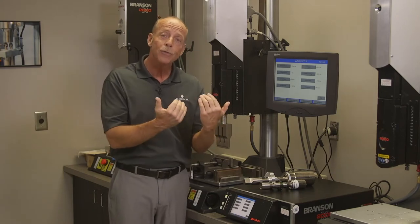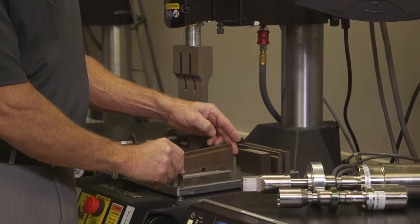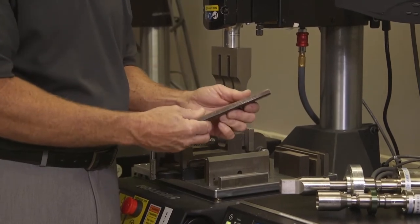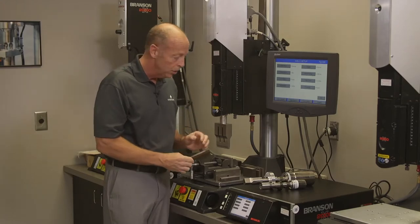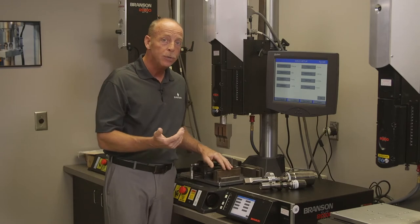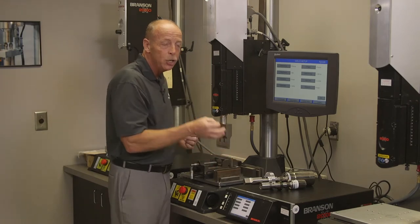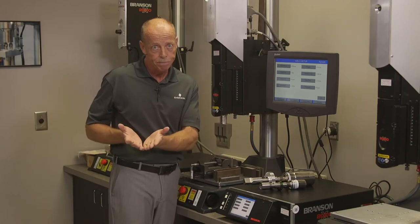But on the receiving or fixtured side, anvils can be configured in many different configurations, similar to heated bar tooling. So many customers will want the thinnest seal surface possible to save material. Some will prefer a serration or a knurl. These patterns are very commonly used in both technologies, ultrasonics or thermal bar tooling. So my point is the lower fixturing is not unique to ultrasonics as much as packaging applications.